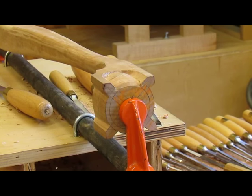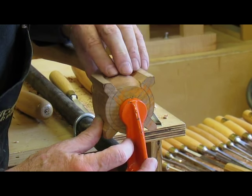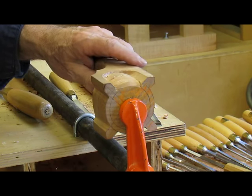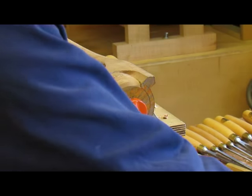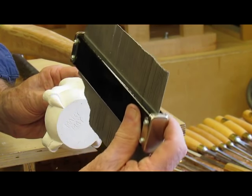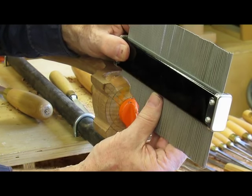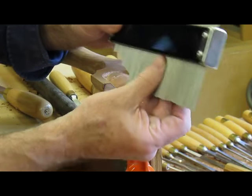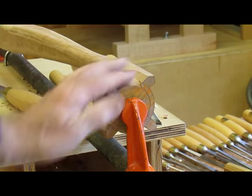I've got the first one rounded over from the center line down to that inner circle. I always have a hard time seeing and carving that curve, so to help me along I have this plaster cast from Mary Mae and a curving or molding gauge. I'm able to put the gauge on the plaster cast to measure the lower half of the ball, then put it on what I'm carving to verify it is curved correctly on the center and two edges.